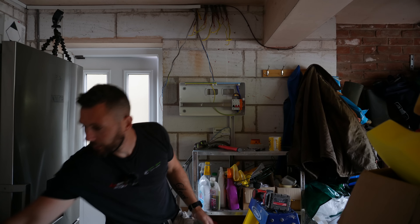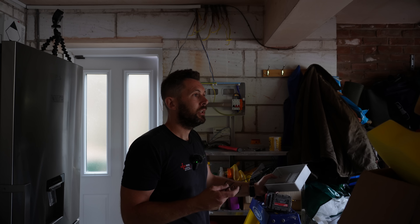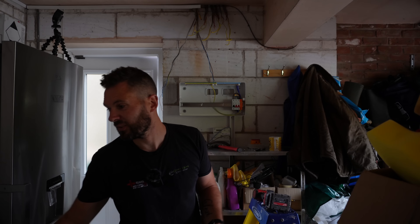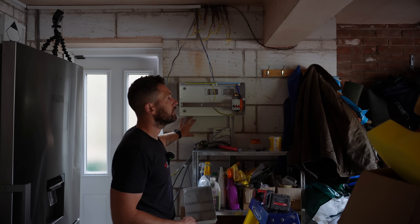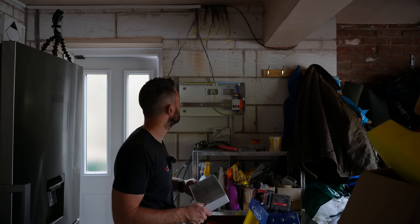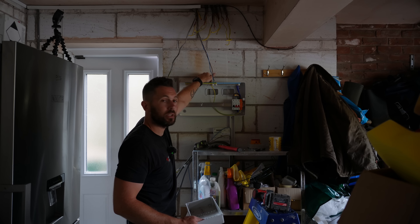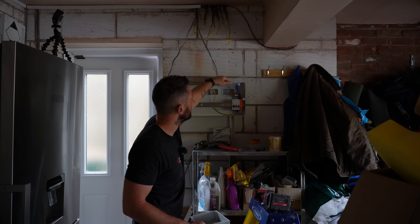It's a light ash block - thermolite. These fixings are actually made by Fischer and they are ridiculously strong. They grab really really well in here. It's not sponsored - I've just tried them and I'm really impressed because thermolite blocks are an absolute pain for getting a decent fix in, but these seem to have solved it. I'm going to use the oscillator now to get the cutout done at the top, get the trunking in so it slides just below the top surface of the board for a nicer finish, and then start rattling all the RCBOs in.